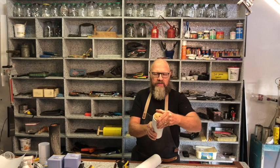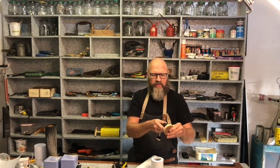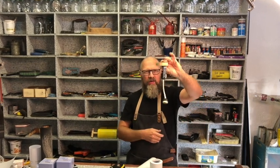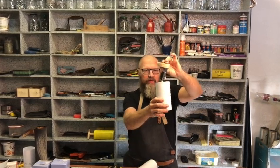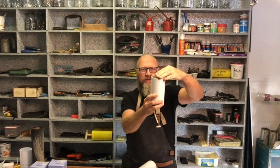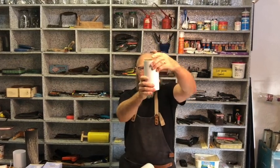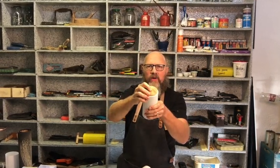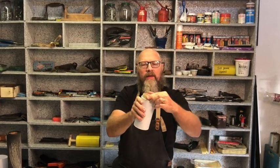And the idea here is to have this screwed into the ceiling with your wire coming out. You make a connection, and then after this is installed like that, you just take this and slide it over, and it's a press fit, and then the downlight is fixed to the ceiling, and you only end up making a small hole for the wire and maybe two or three holes for the screws to hold this onto the ceiling.